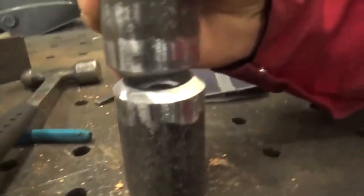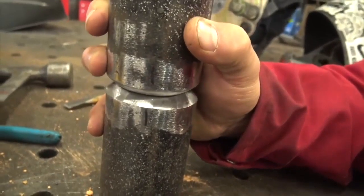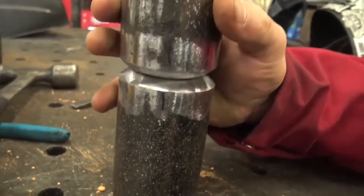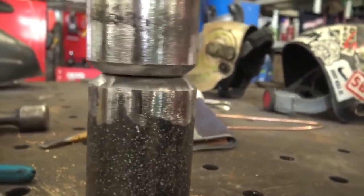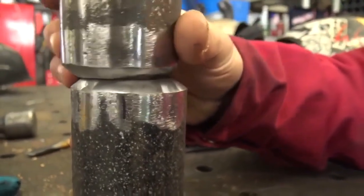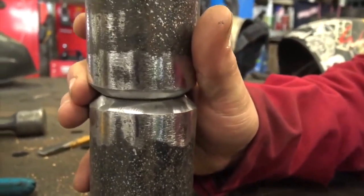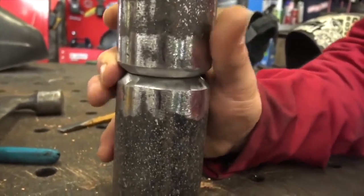What I was going to say about the marker points — you have highs and lows, so you want to find the best sandwich fit-up. What you can do is roll that top pipe and as you roll it you'll see gaps where they're not going to fit up perfectly. Find the best fit-up orientation and mark it so when you move the pipe around you know where to go back to.